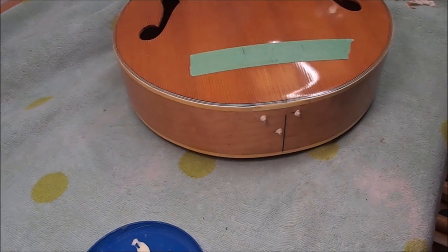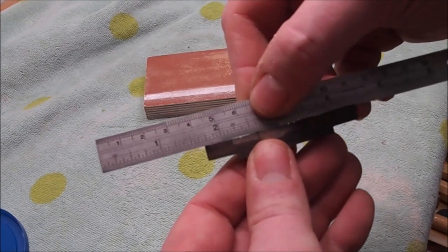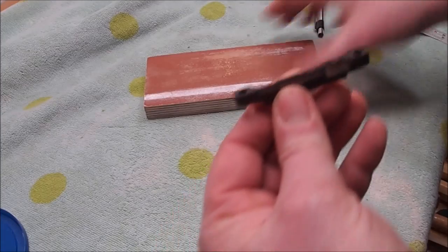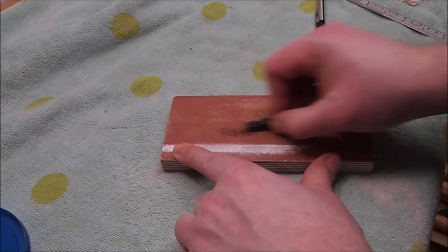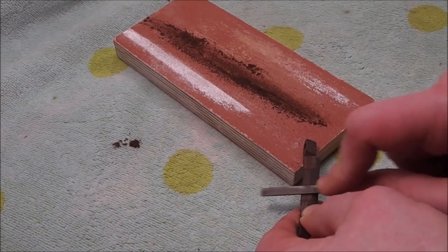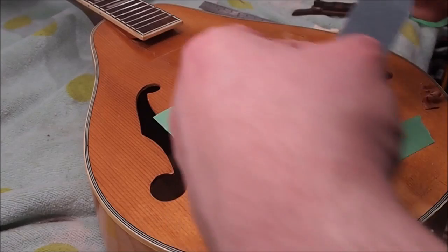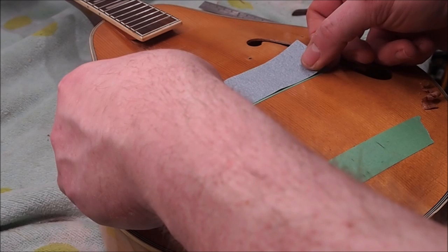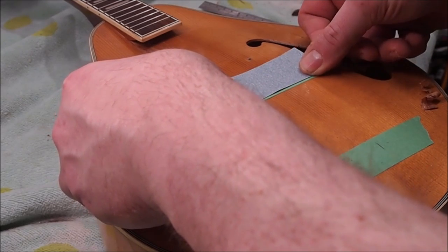After those dry I'll flush-cut them. While the dowel is drying I'm going to work on the bridge and saddle. It's warped slightly concave over the years and I'm not entirely sure I trust the spacing, so I'm just going to flatten off the top a bit and crisp up the intonation angles slightly. The bridge doesn't have great contact with the top surface, so I've got some super glue on sandpaper adhered to the surface on top of a piece of painters tape to fit the bottom to the top.